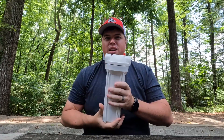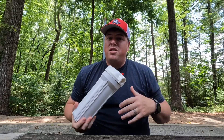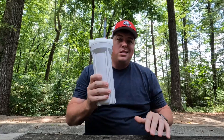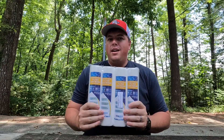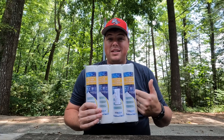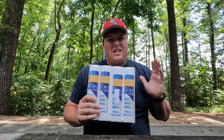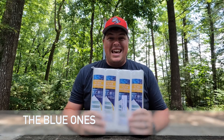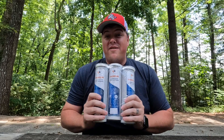The first thing on the list: filter housing. This is a standard 10-inch filter housing. You can buy 10-inch filters online on Amazon, at Home Depot, Walmart — that's why I decided to go with this. It's not a proprietary filter size, so it's going to be available. This one has a little purge valve. I bought three of these. Next, we've got our sediment filters. This is going to be your first filter in line, so everything's going to come in contact with these first, and they're probably going to wear out faster than your other filters. These are 20-micron filters. A lot of your cheap inline filter housings are 20-micron filters, and this is our first line of defense. They came in a pack of four and were really cheap.